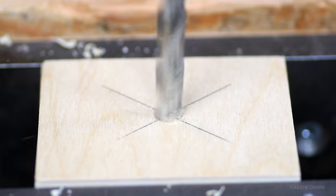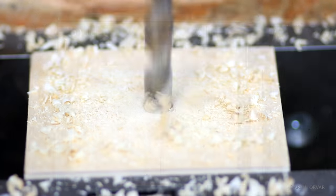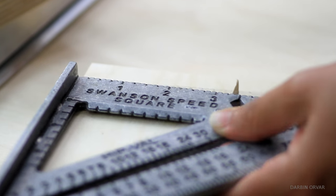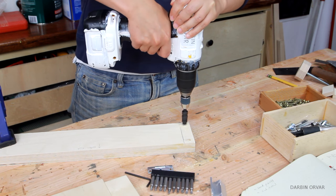In anticipation for the box joint jig, find the center on the glued up sides, cut D, and drill a 3/8ths inch hole in the center. Now let's pre-drill the fence — take one of the sides, mark it out on the end of the glued up fence, and drill two holes so the pieces can attach later.